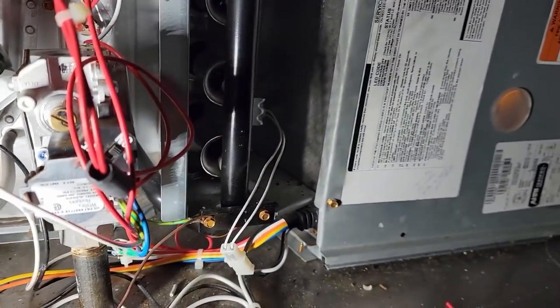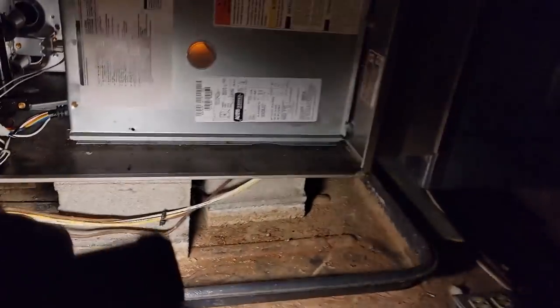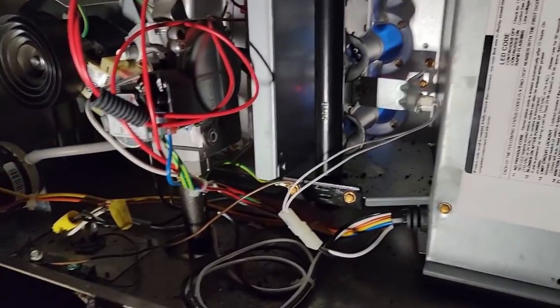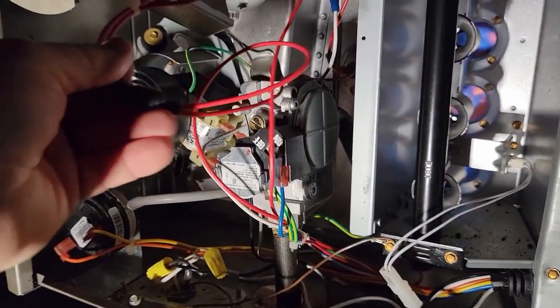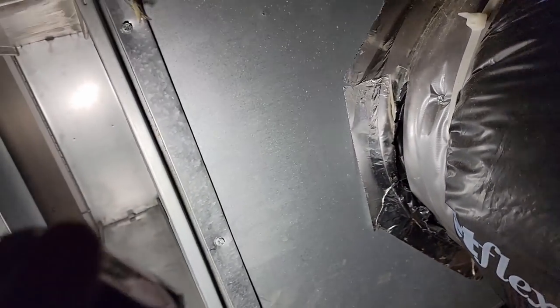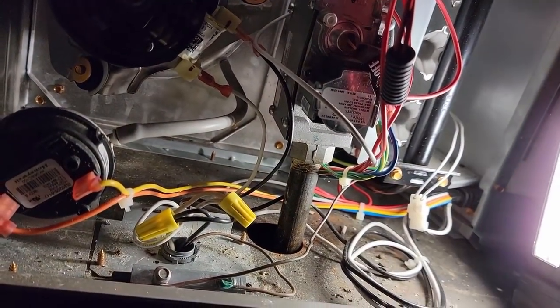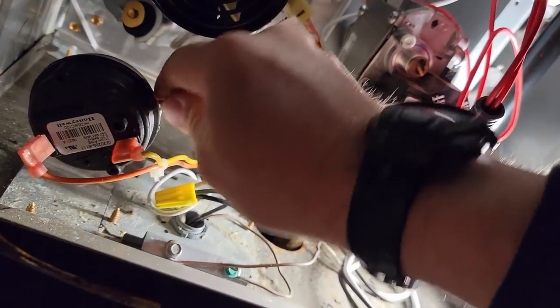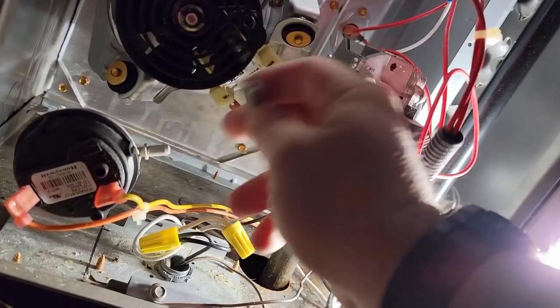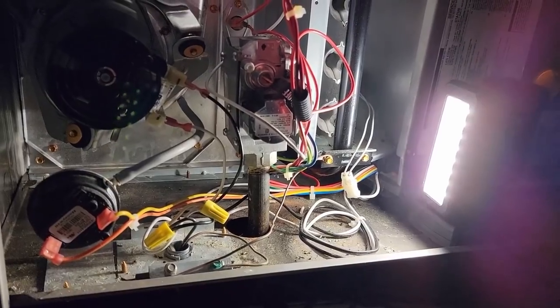At least it's grounded. Not seeing any blinks on the lights from here. Gas pressure looks kind of low — is this a two stage? Nope. There goes the fan, fan's coming on. Filter was changed in November. It turned off again, never flashed anything. Let's double check a few things — make sure we're not getting water in the pressure switch hose or anything. I'd rather see it drain back to the collector box, but I don't think that's it.